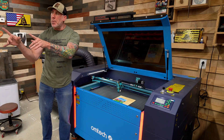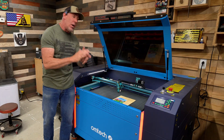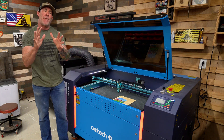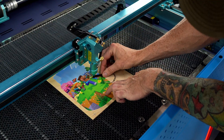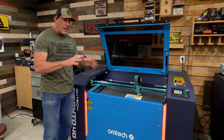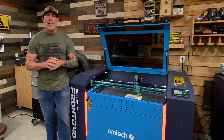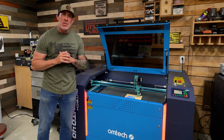Once you're satisfied with your print job, go ahead and place your material inside your laser engraver. We're gonna be referencing those two registration marks. My first order of operations is to get this laser in focus. Now this is really important — a laser engraver does not have a brain. The brain behind a laser engraver is right here between your own two ears. You are programming and telling this machine what to do.